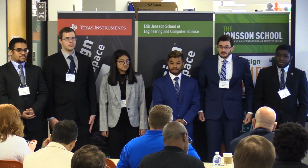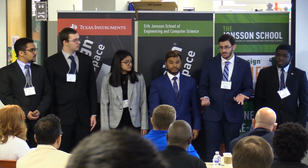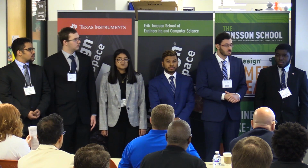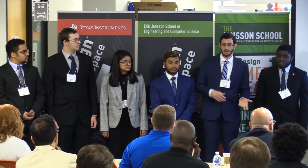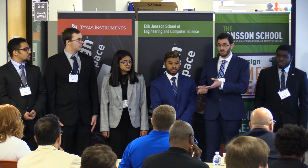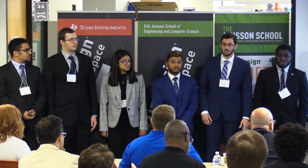How did you utilize the IMU? So right now we're not utilizing the IMU. Not all of our applications require all of the different sensors. Nonetheless, we can operate them all together. One of the usages for the IMU is potentially detecting the tilt and rotation of the car, or even integrating the acceleration to get an estimate of the velocity, which can then be fused with the encoder estimate of velocity to produce a better estimate.